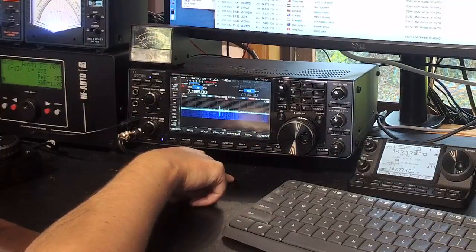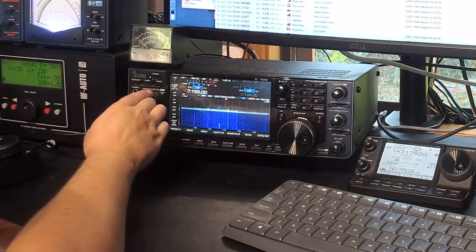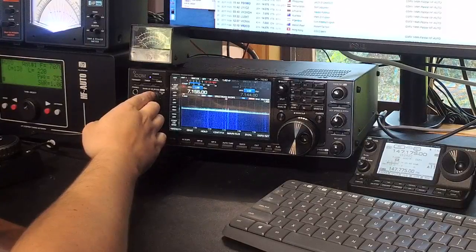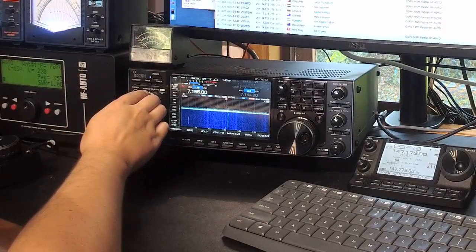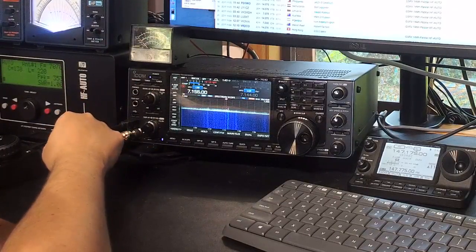It will give you exactly what you used to get with the old IC-7000, where you could plug into a composite output and blow it up, but you wouldn't get any more resolution or detail — and you're not going to with this either. Just because it's got HDMI on it doesn't mean it has a high definition output resolution. In fact, 800 by 480 only qualifies as standard definition — lower than even the most rudimentary of early plasma TVs.